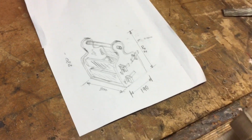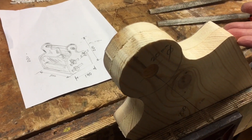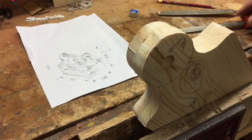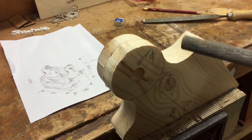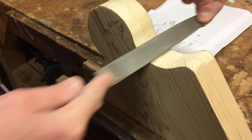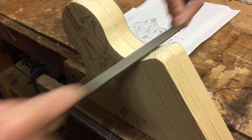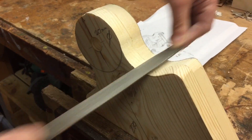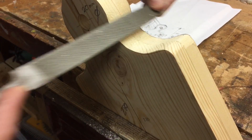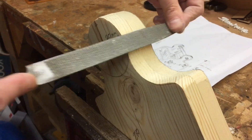There's our design — I'm going to draw that up much better for our viewers. These two bits together have to be symmetrical, meaning they have to be the same. We're going to use a rasp rough file to try and get that curve even better, then find a finer half-round shape to finish it off. This has to be held completely horizontally — if you rush this part of the job the whole thing starts looking shoddy. Take it easy Shedhackers — if it takes you an hour to do the whole two sides, that's probably an hour well spent and you get them all the same.